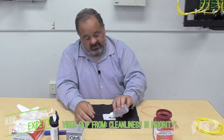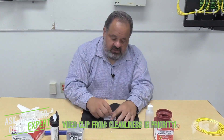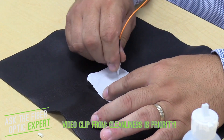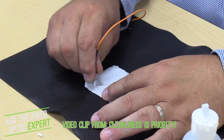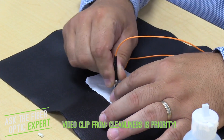If we move to the de facto standard of cleanliness — the 10 commandments of cleanliness — it's the wet-to-dry method. The standard is to take alcohol, put a little puddle in the middle, start in the puddle and pull away, going wet to dry. It's also recommended that you spin it as you do that. That's the de facto standard — not necessarily the most practical in the field, but that's really the standard.